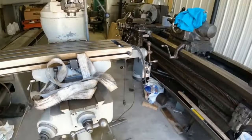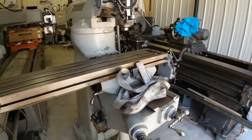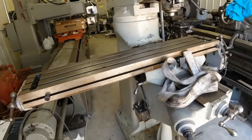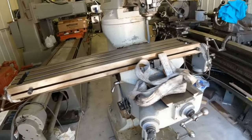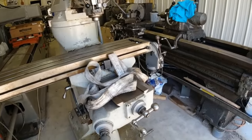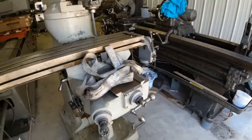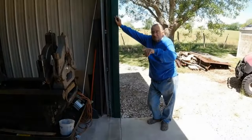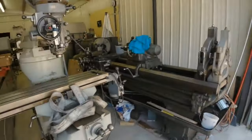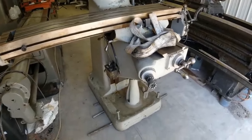And the guy I bought it from was a machinery builder. And he said, all it needs is a nut. Well, I've been digging into it and it needs a lot more. It needs both screws, X and Y. Needs nuts for them. Needs bearings, needs oilers, needs way wipers, and may need a ride on my planer. Well, when you wear out a lead screw as much as this one's worn out, it's been used a lot. Wearing out a nut's one thing. Wearing out the nut and the lead screw, that's a whole other story.